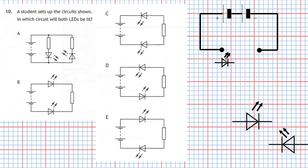If you have a series circuit and you connect two LEDs like this, then even though one of the LEDs has got the pointy part of the triangle connected to the minus part — so it's correctly positioned — it still won't light, because its partner has the pointy part of the triangle connected to the plus side. That blocks the current, and if it blocks the current it's going to block the other LED too, so none of the LEDs will light up.